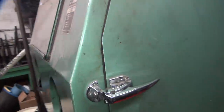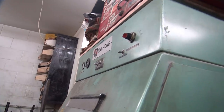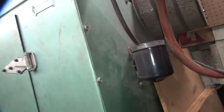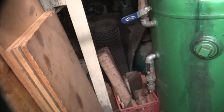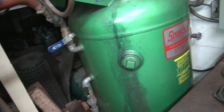So that's how the blaster works. I regulate it down to about 80 pounds — looks like it runs about 70 when running. I'll have to go in and crank this thing up a little bit. The regulator's been acting up. I haven't been using this blaster for quite a while lately — it's been out of service for years. So getting the parts working again, everything is a little different from sitting. I've got a lot of air volume in there — 80 gallons here and 80 here, 160 gallons total.